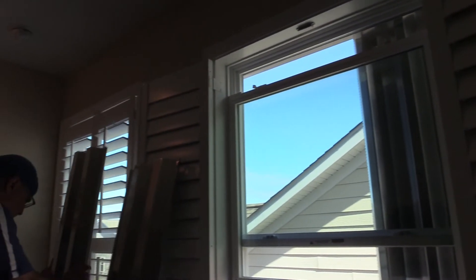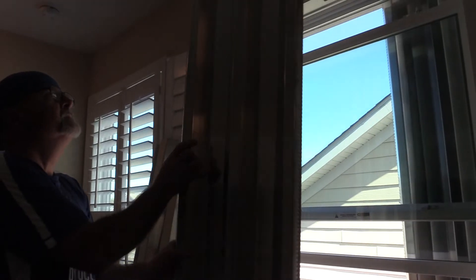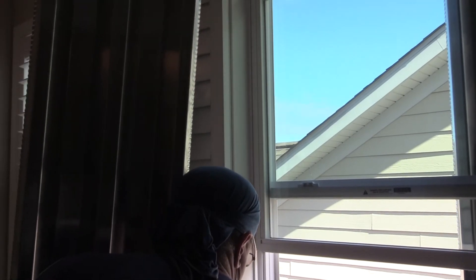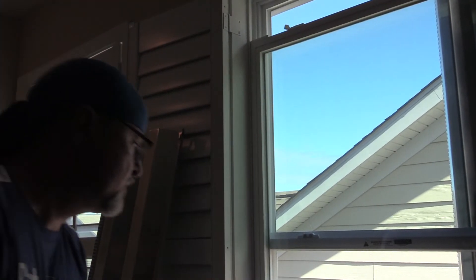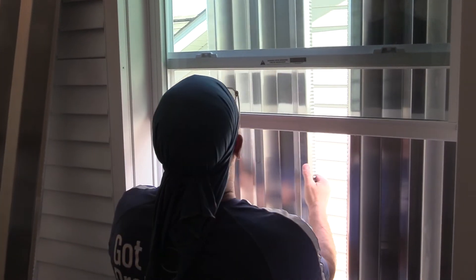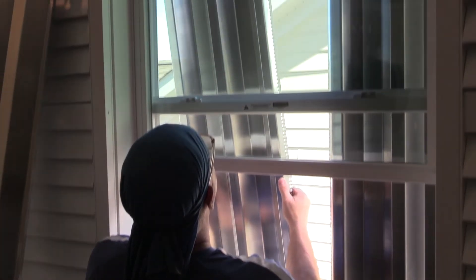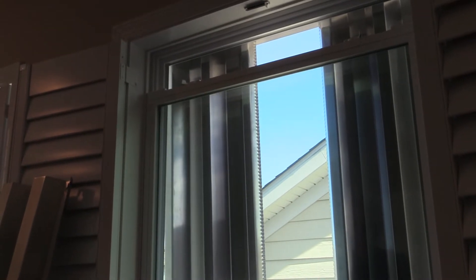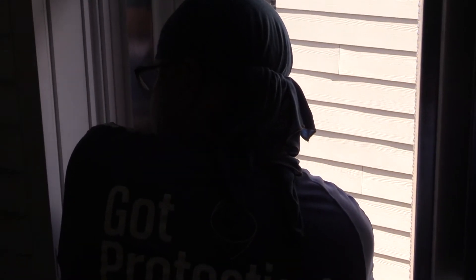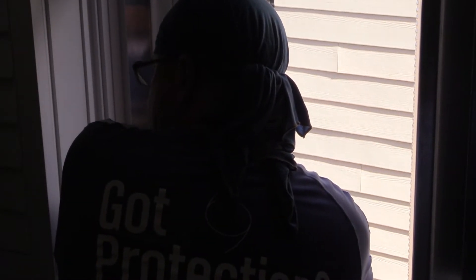We locate the left-hand panel. The left-hand panel has the hole towards the center. We grab wing nuts — at least two. We slide the panel through the window, back down on my knee so it won't fall out, tuck it in the top, and put it over the studs. Slight pressure holding it in — it's resting on top of the studs. Once we get a nut on it won't fall. Tighten up the center.